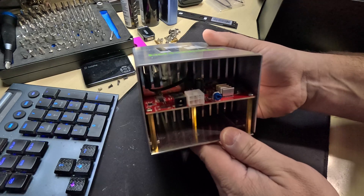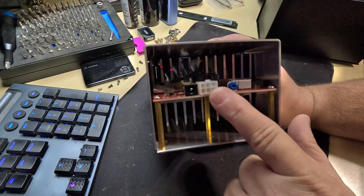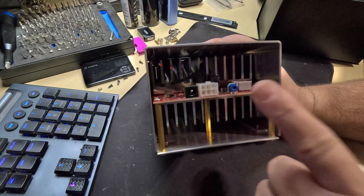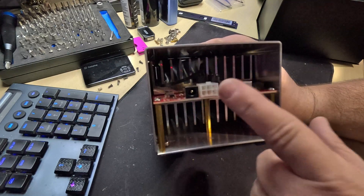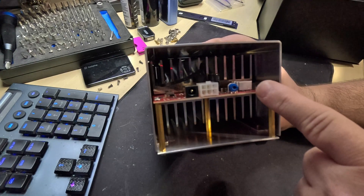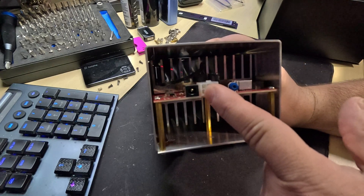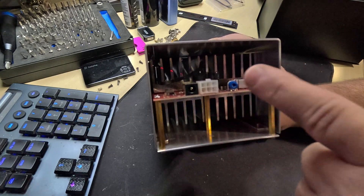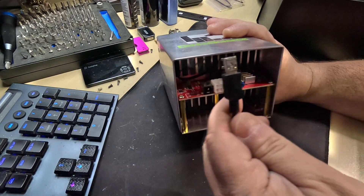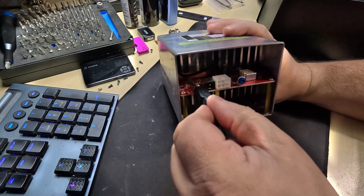Can you find it? Let me show you here. So as we can see from the back here, it is powered either by a six pin or a barrel jack adapter. I'm not sure what this potentiometer is for — I'm not even going to touch that. This does not have a microcontroller on it to control the hashing and everything else. It's probably just the hash chips itself. It's meant to be connected through USB, either to a Raspberry Pi, some other little ARM single board computer, or your PC that will send the information so this can do the work. And right here is what's left of the mini USB connector — it accidentally got ripped off the board itself.